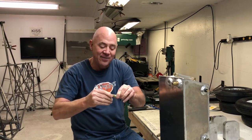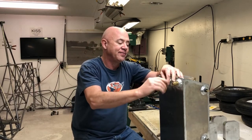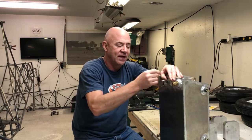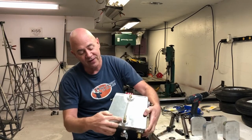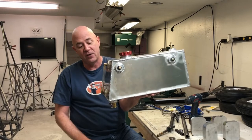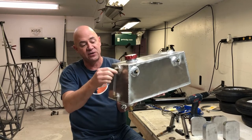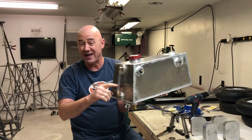I don't plan on using that reserve in my airplane because of the way my tank is angled - if I started to run out of gas and flipped to reserve, I'd probably have a pint, not even a quart. A lot of people have been asking about my fuel gauge. If you look right here, I have an elbow, another elbow, and a piece of gasoline-rated clear tubing. When flying, the tank will be at an angle and I'll have a mark showing half a tank. When gas fills the tube I've got more than half; when it bobs at that mark it's half; and when it drops further it's about a quarter tank - and that's when I'll be landing.